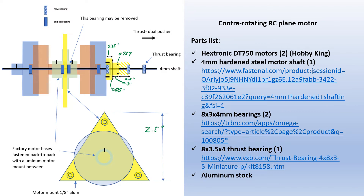Here's the parts list on the right and a rough drawing on the left. The two brown areas are the stators. The two blue areas are the rotors and the yellow pieces are the ones that need to be machined. The yellow piece in the center is just a triangular motor mount. The yellow piece to the right is a bit more involved — it's a prop mount that has a fore and an aft bearing. That prop mount has to be concentric with the blue rotor, and then there's a thrust bearing that goes up between the two propellers.